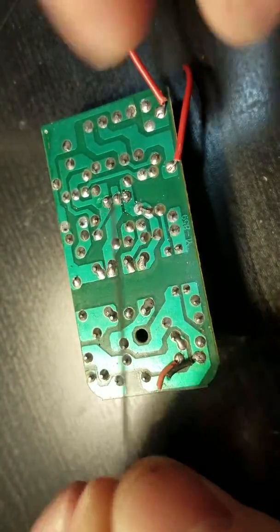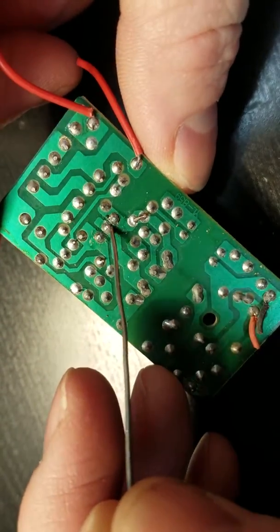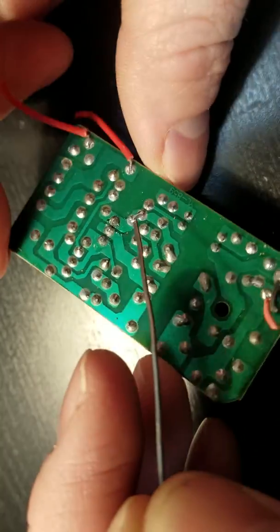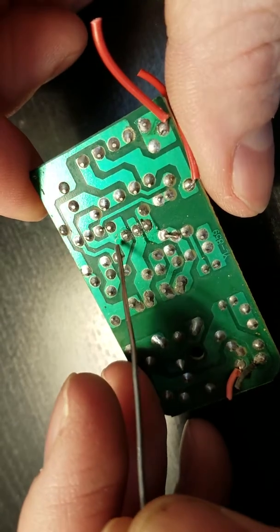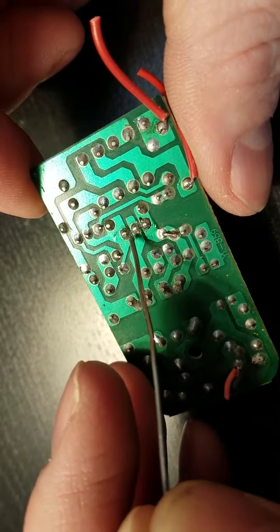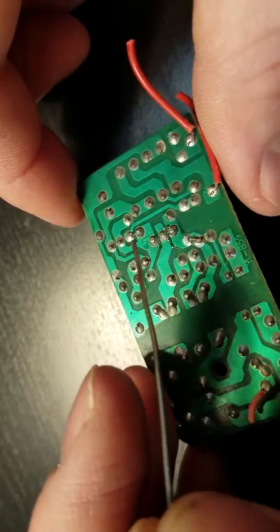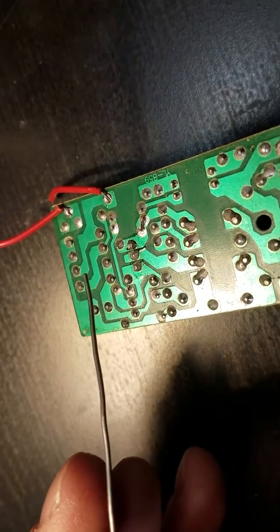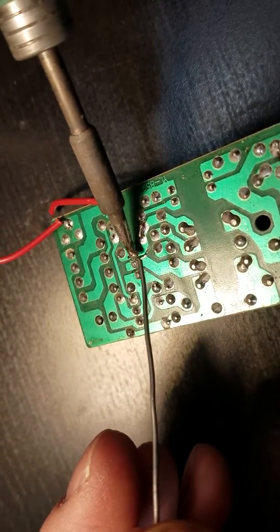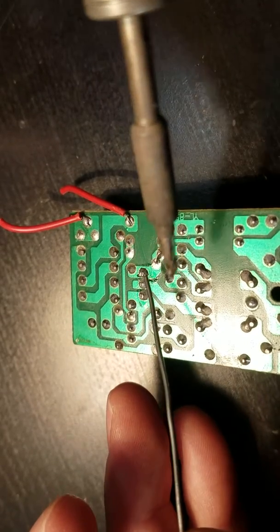So what I'm going to do is start, and I haven't touched this before, so these solder joints might be older. But one method I found that works quite well, especially when you're removing multiple pins and you don't want to trash PCBs or these traces, or rip them through or dig holes in the PCB, is to add enough solder that you actually bridge all of them. It seems kind of counterintuitive, like that doesn't make any sense, but we're going to try to, once I can balance it, this is a fun thing too, I'm going to try to add a bunch of heat to it.